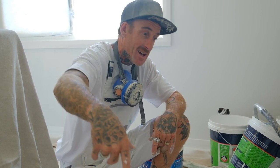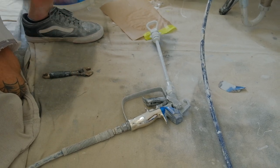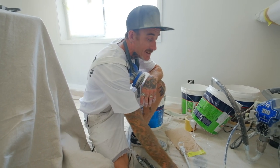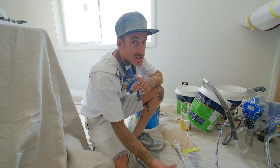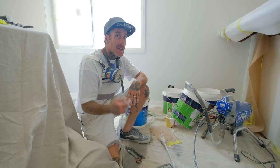But hey, what has happened, and we've got the man Jacob from Go Industrial down. What a perfect time to do a quick video on when your handpiece, your spray gun, has clogged. So first things first, you gotta check your filters. This thing here has probably done about 7 or 8 jobs without even cleaning the filter. It's probably the quickest, easiest thing to clean to eliminate clogging, and I haven't done it.